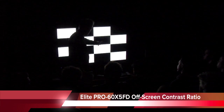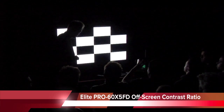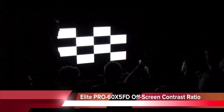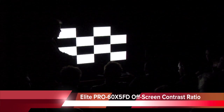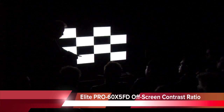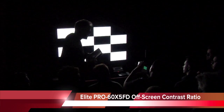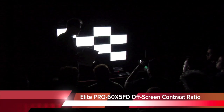Now guys, why don't you shoot to the middle of the black box for me a little bit? Kevin, one thing I would say for the audience: to measure black, regardless of whether it's on screen or off screen, your sensor has to be sensitive enough to actually measure it. This one is probably not quite sensitive enough, but this will give you an idea. It's not going to be 100%. When it measures black, it takes a really long time to get the number. So shoot it, and then we have to listen for a beep.